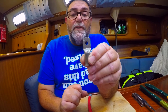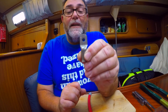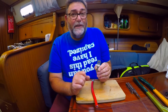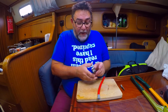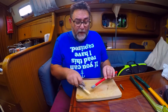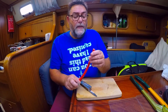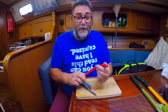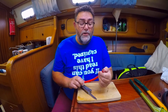I'm going to explain how to crimp a lug properly and maintain its integrity. I've already marked the end of the cable. This cable is tinned, so it's very flexible and it's probably about three times the price of normal electric cable, but it won't have the same corrosion issue.